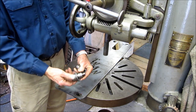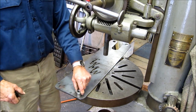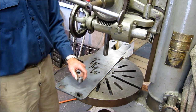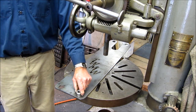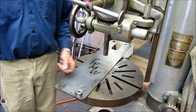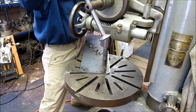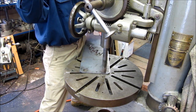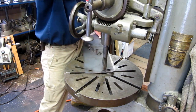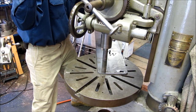We've got the bosses that are going to hold our rollers, and these bosses are going to be inset in these plates. We plasma cut those holes out to inch-and-a-quarter — this is inch-and-a-quarter diameter — and you can see the slight interference there. So we have an inch-and-a-quarter reamer here and we're going to run the reamer through our holes, set the bosses in there, give them a tack, assemble our rollers, and then slide it into the track unit to have everything work out properly.